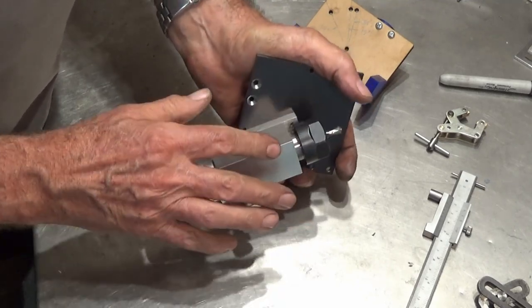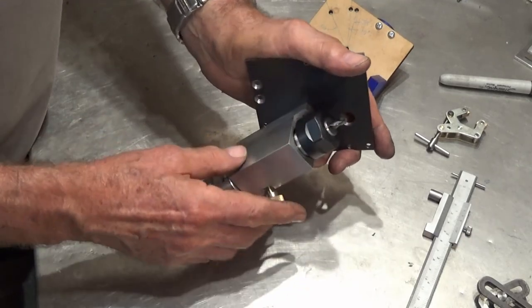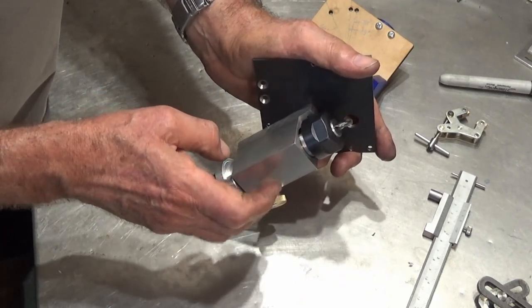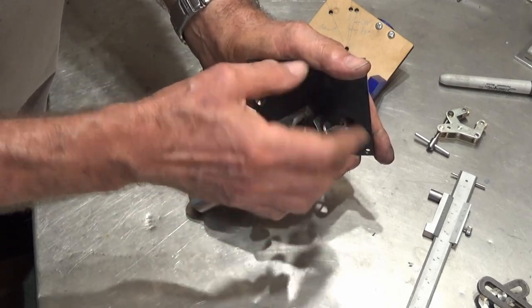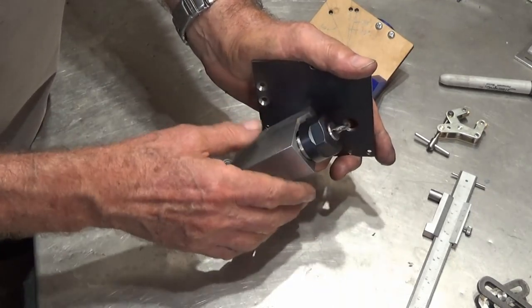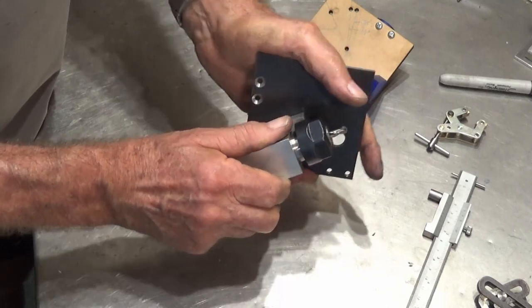And when you're using this drill grinder, you do need to remove this collet block to inspect the tip of the drill. That was one of the things I liked about this style of drill grinder. If you're using a Deckel clone and you've got the drill bit in a collet in the workhead, once it's in there, you can't easily take it out and check it. If you remove it from the collet and try and put it back, the geometry is all changed. With this, you can just remove that whole assembly.